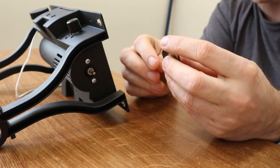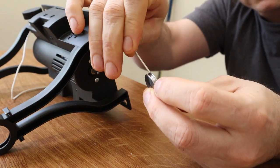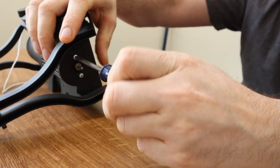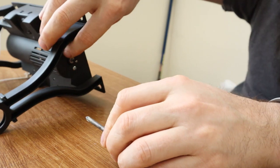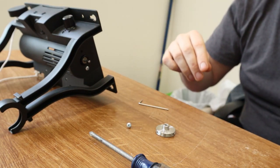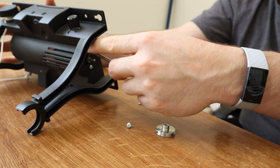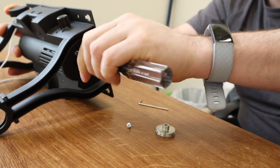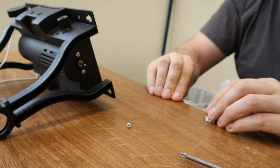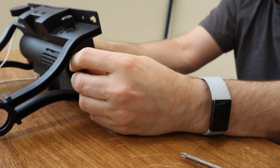I've already taken off the little motor pulley using the hex wrench — it goes into the set screw and pops off really quickly. One trick I found with changing these screws is to take out one at a time so the motor doesn't shift around — I find that works pretty well. I won't show the second one but it's the same thing. The screw I just put in is just one millimeter shorter than the one I took off. After the two screws are changed out, that prevents one possible problem.